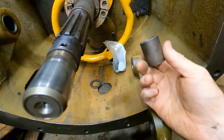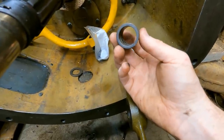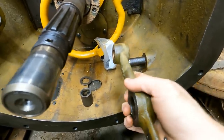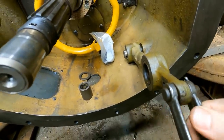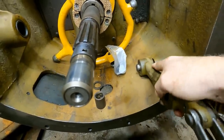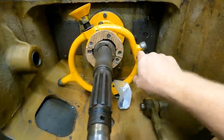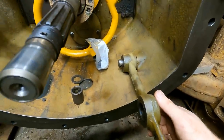This goes in the transmission cover, and the bearings in there had the same grooves that were empty. So I'm assuming that's graphite. Besides this bushing missing all that graphite, it's actually still really tight. So I'm just gonna pack it with grease, and it'll hopefully be fine. I'm not gonna go get another bushing for that. Like I said, it's really tight on there. It's not worn at all. So I'm just gonna pack it with Molly grease, and same for this and this, which go in that socket and this socket. And then we'll call that good.